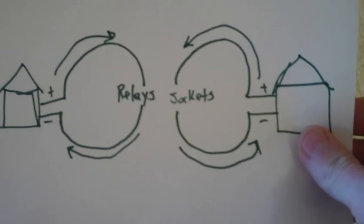This is the HP power supply. What we're going to look at is the left side of this drawing — the relay circuit. This is powering the relay board, so the negative and positive are going into the relay board. That's feeding a negative and positive circuit to the Arduino, which then completes the path. The Arduino doesn't need another power supply; the relay board is powering it from this HP power supply.